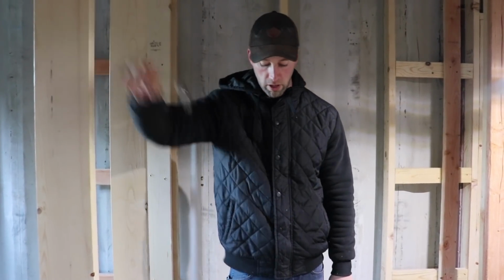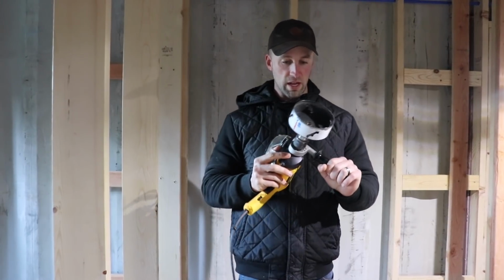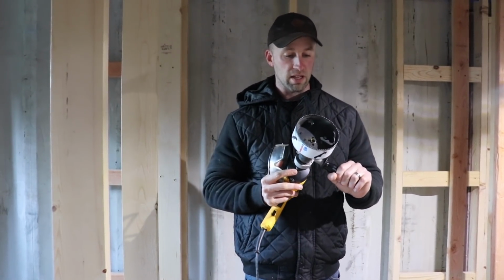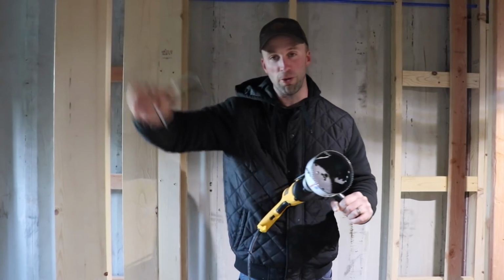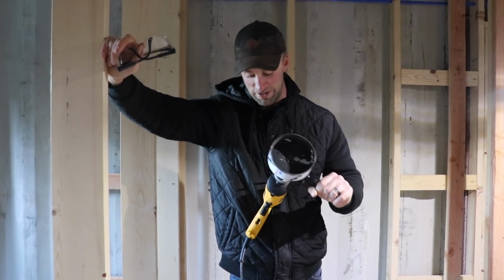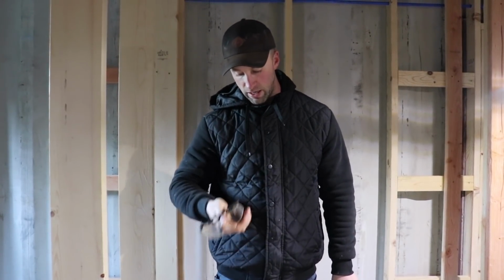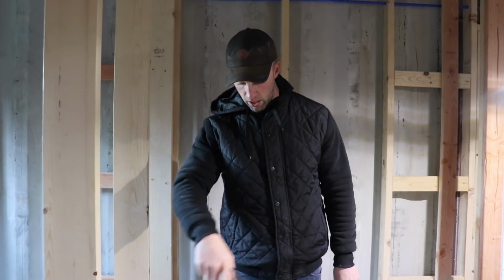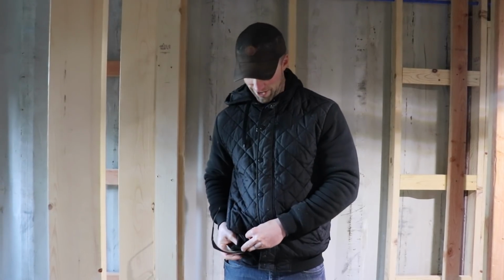All right, so cutting the hole through the floor so far hasn't been that bad. A little bit of a pain in the butt, but the biggest thing was I knew this big hole saw probably wouldn't last that long. I wasn't expecting this short of a life, but I figured I'd be able to at least cut both the toilet holes out, but apparently not. It's going to be one hole saw per toilet, so it is what it is. There's still a little bit of not quite a beam underneath, but it's like an additional little ridge. So I'm just going to have to cut through half of that. I'm going to use my reciprocating saw, but who knows how that's going to go. And if the reciprocating saw doesn't work, then I'm going to have to bust out the grinder and get underneath the containers.